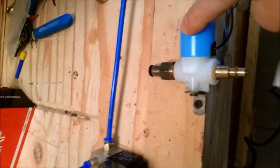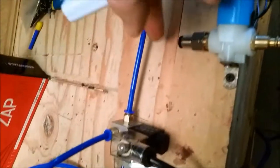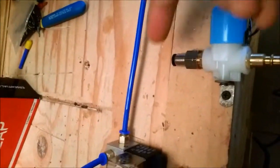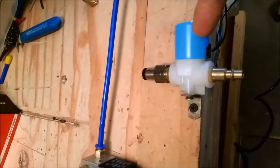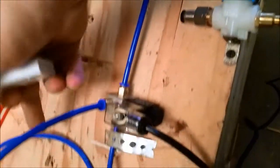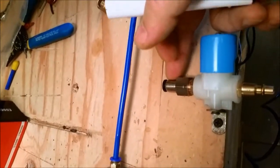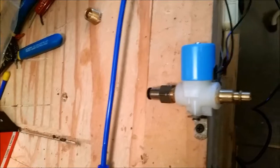This is a previous solution I had done with a different solenoid — it does not have that relief, so it closes much more slowly as the pressure simply leaks off. You could still use a solenoid like this, but you'd want to put a small hole in your tubing or find a relief valve of some type to attach on that side.